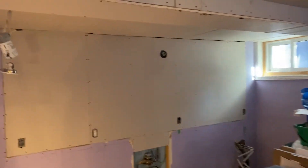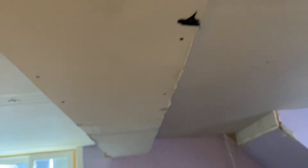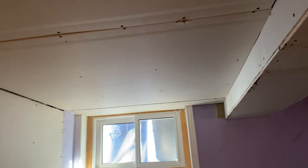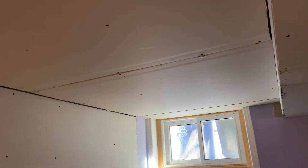This is the kitchen area. We boxed in the bulkhead — you can see some of the acoustic sealant. What we did is two layers of drywall on the ceiling, which gives it roughly about a one-hour fire rating when you add up the two layers and the sound attenuation fireproof insulation in the cavity. When you measure, you count the whole space not just the drywall, so it's about an hour fire rating — but we were primarily looking for soundproofing.